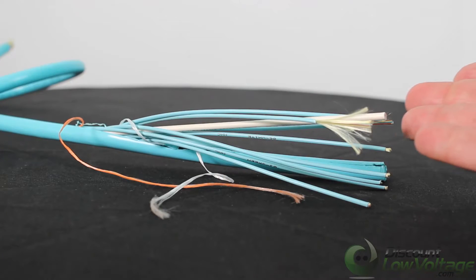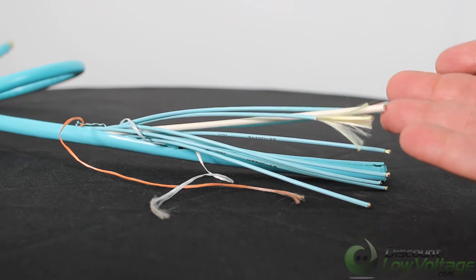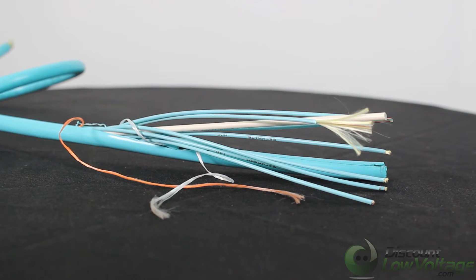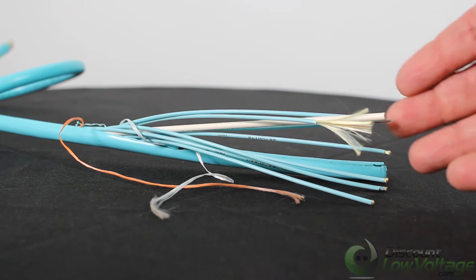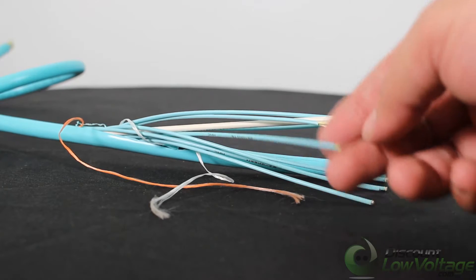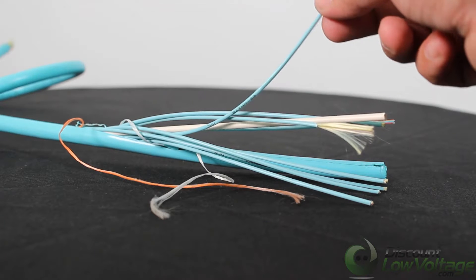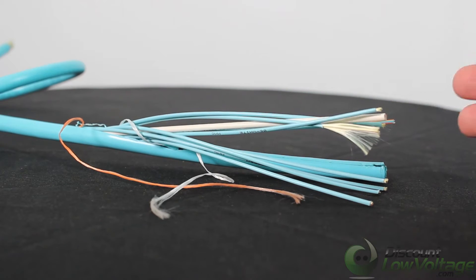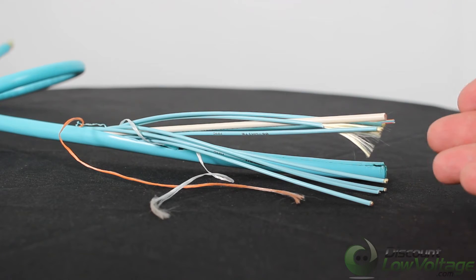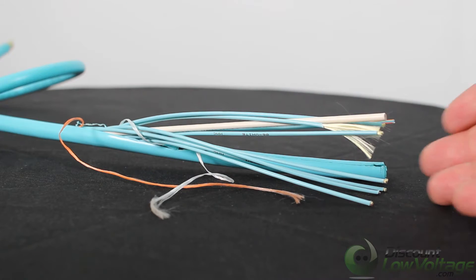This is the AFL Microcore and it is designed for high density infrastructures — you'll get significant savings in both space and fiber management and routing infrastructures. You'll notice there are 12 strands per sub cable, which is suitable for individual routing paths within the rack and panel architecture. These are designed for direct termination and are supportive of both single fiber and multi-fiber architectures.